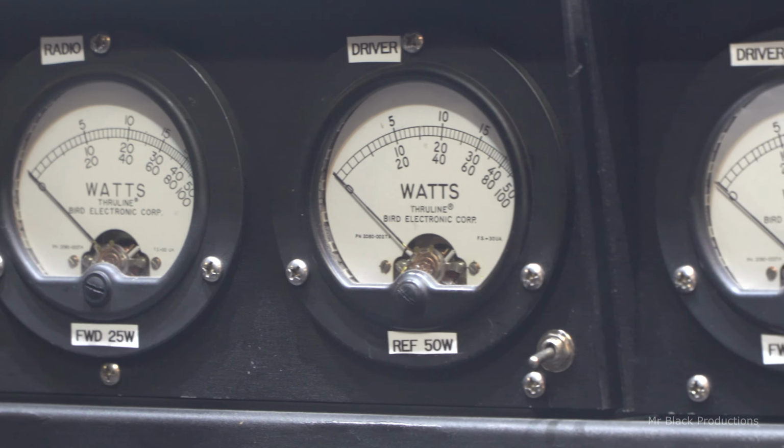And let me show you where it comes through the floor. So let's come back around here and let me talk about this for a hot second. So there's two schools of thought when it comes to running ground. You're going to have your primary ground conductor, and then you've got to have a physical mechanical bond to ground. Well, these are our RF bonds that look like this, braid. And you can see where we've got it done in multiple spots on the truck.